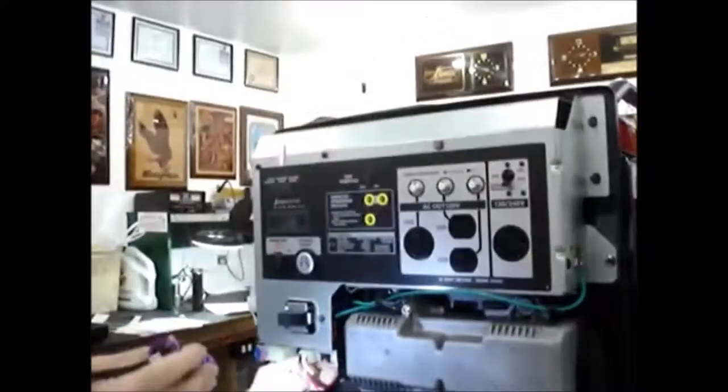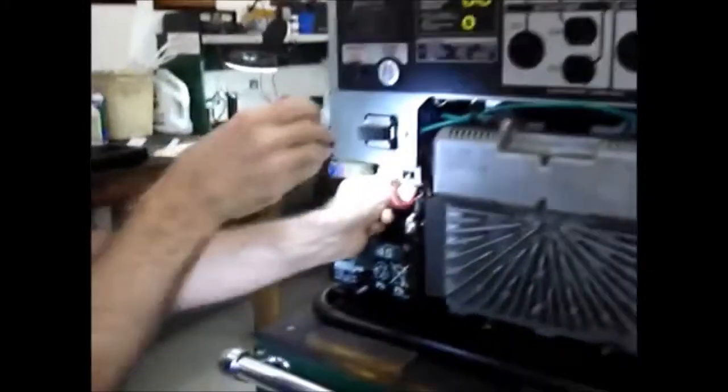Okay, at this point, we can go ahead and snap the remote control plug. You can see the hole that it goes up into. We're going to push this in here and then slide this straight up, and it engages to the top of this. I am going to go ahead and take the tie wrap and tie wrap this harness to the negative battery terminal wire. That way all the wires stay in a nice clean loop.